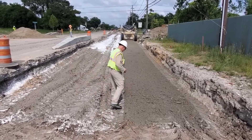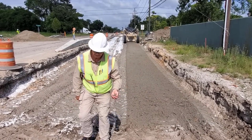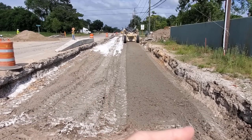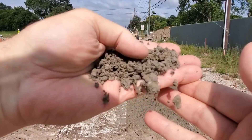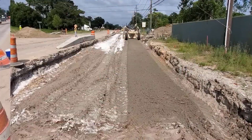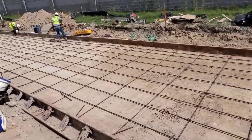Here's what it looks like now. You saw what it looked like before they put the lime down — it's pulverized it and it's looking pretty good. Now we've come to the next phase: it's been compacted and the grade has been cut.